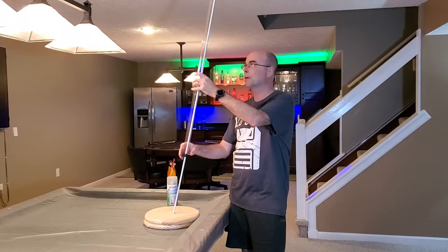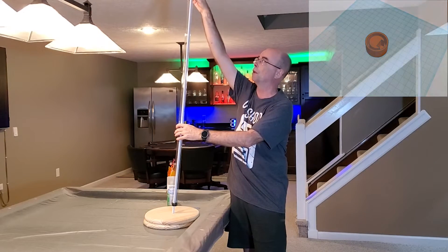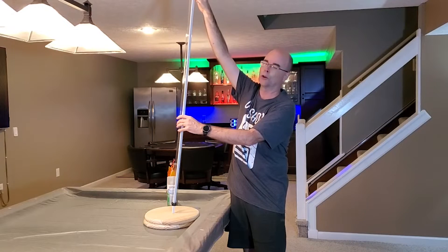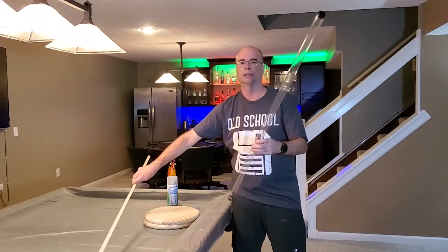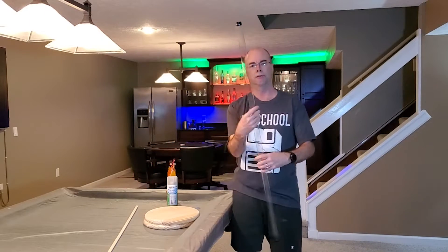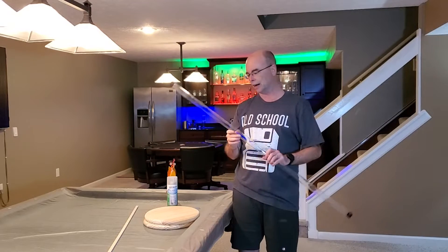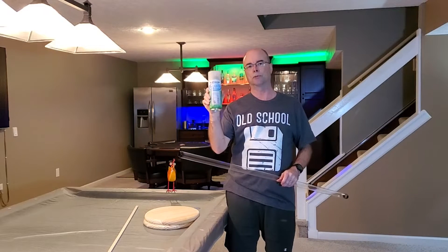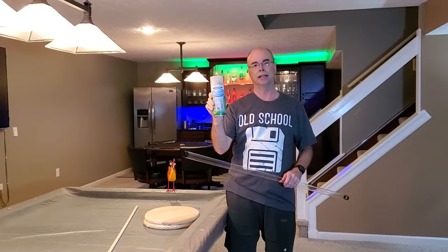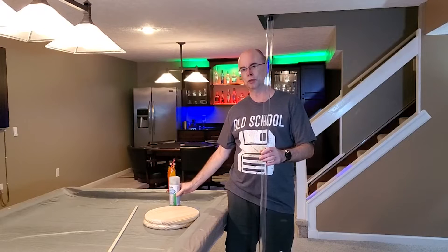I'm planning on designing a 3D-printed part for the bottom to hold the tube, and a cap for the top that will help hold the piece of wood and prevent light from coming out. We definitely don't want a clear tube — we want some kind of translucent diffuser so we get more of a pattern and won't see all the individual LEDs. I'm going to try frosted glass spray paint; I've used this before on things like my LED matrix clock.